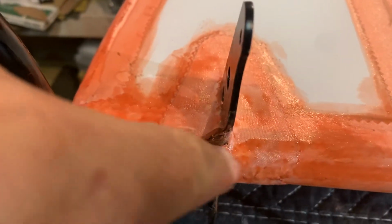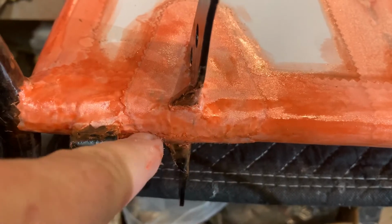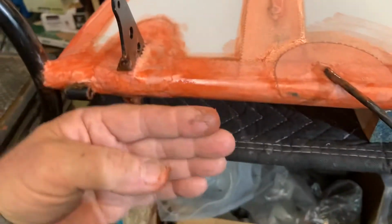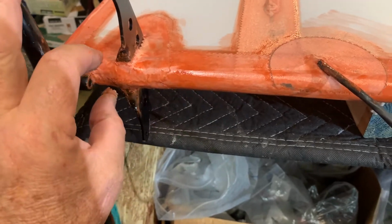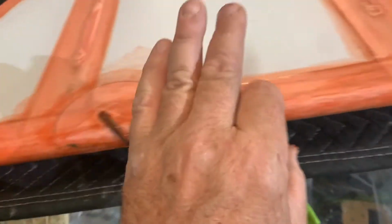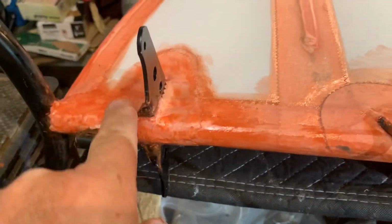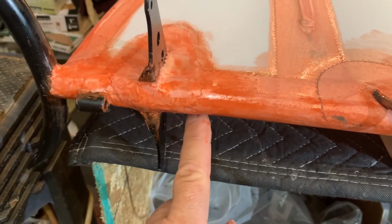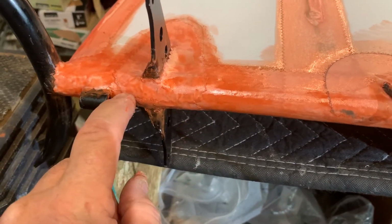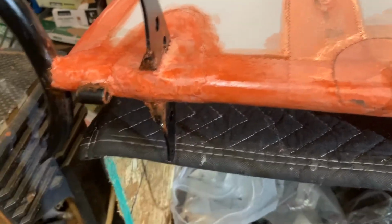You're going to cut it to the shape here, or here, and here, and then just take it to the middle, and then I cut it across in the middle there. You're never going to see this joint because it's going to butt right up to the fuselage. And then if you're like me, you're going to put the gap seals in there too. That's going to go in there. You're never going to see any of that, so it doesn't matter. It's got the pink cut there. It would actually wrap around a little further and you'd see it on that side. I don't like that, so I just cut it across here and let this one stop. The other side stops there, and away you go.